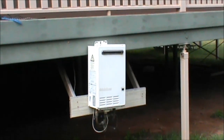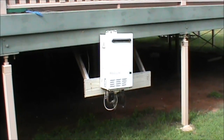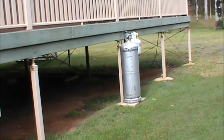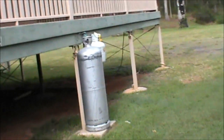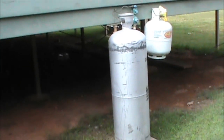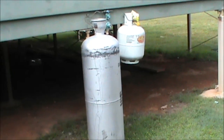Other types of heating — I won't go inside the house for privacy reasons — but you can get wood heaters and wood stoves that have water jackets on them to heat water. In the hot summer months here you really don't want to be firing up a wood heater inside the house. On many of the older homesteads going back 50 or 100 years, when they had wood stoves with water jackets, it was quite often built as an extension to the house where the heat dissipation helped with hot summer temperatures.